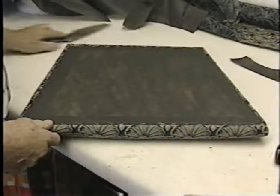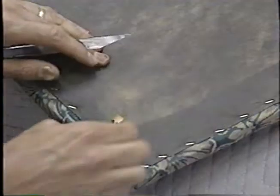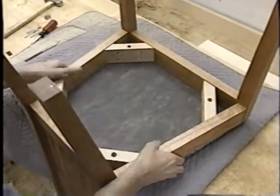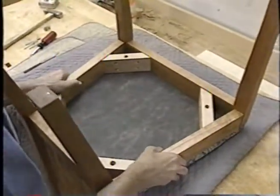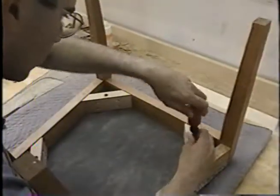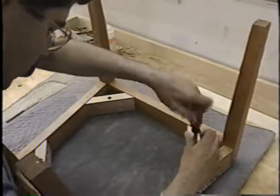The whole seat should take about 20 to 25 minutes. Back in my shop, I carefully cut little windows in the cambric, exposing the T-nuts. I used to think that drywall screws were okay as seat fasteners until my kids kicked their dining chair seats right off their screws. They'd have a heck of a time kicking this chair apart.